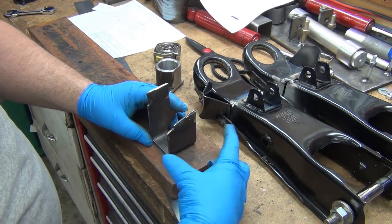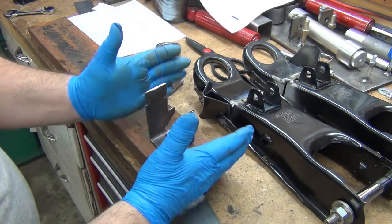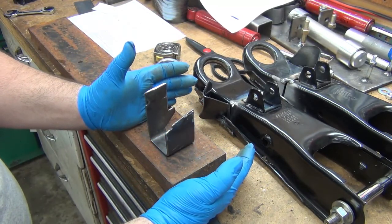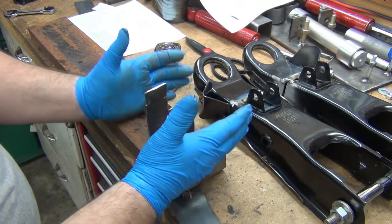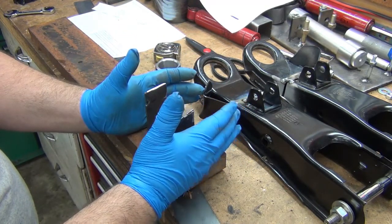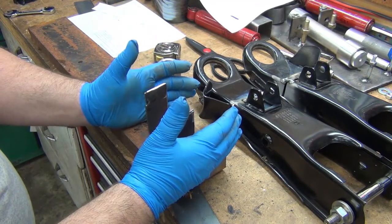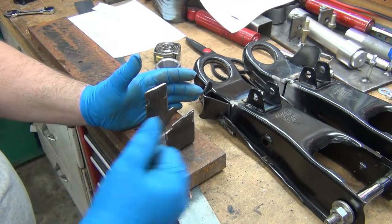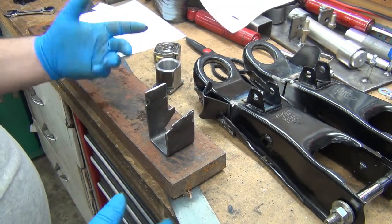Part of the reason for the width is that I've got enough strength on the sidewall. If I make it about this long, it'll span the rails on my press, so it'll be easier to hold and set up. That way I could keep a clean shot through the bottom, and the other thing is I could weld or tack down a tab.